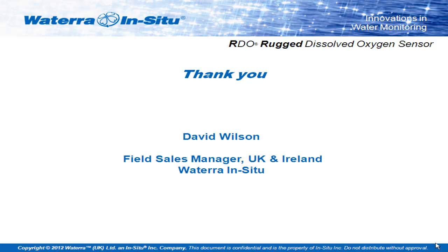Any other questions? I've just got a quick question for David about speed of response. In the earlier versions of the dissolved oxygen sensors they were quite slow — where are they now and where are they heading? For optical dissolved oxygen sensors, typically you're looking at a reading in less than 30 seconds for most commercially available sensors for natural environmental waters and wastewater treatment. Some units for marine systems can get sub-10 second intervals and faster. My question on the very fast sensors is always: how accurate and stable is the reading? You can get a reading instantaneously, but whether or not it's accurate is another question.